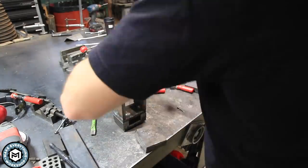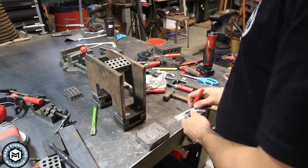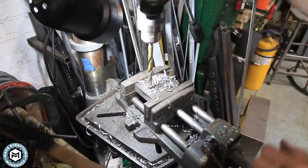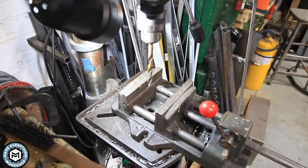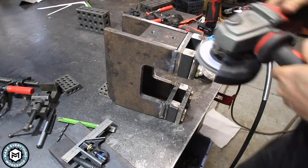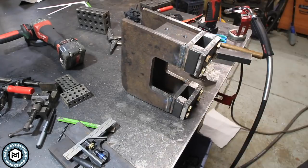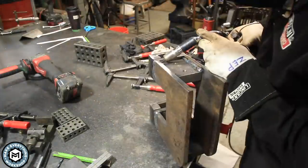There are a couple of spacers I wanted to put in between the frames. One is a one-inch thick piece that fits nice and tight in between the two side pieces. I drilled a couple of holes in it so I could put hardware through it and a post down into the hardy hole of one of my anvils. I'm going with seven-sixteenths Allen-key bolts again. I recessed the hardware about three-eighths of an inch so I could put a weld bead on both sides — it won't protrude from the bottom and it'll be nice and strong.